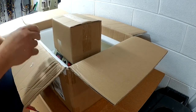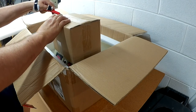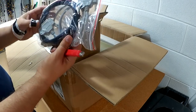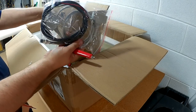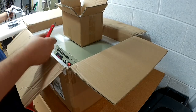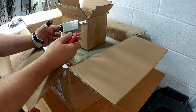There's another box inside. The interesting thing I just realized is that the 3040 came with the steppers already attached — a lot of the unboxings I remember seeing had to attach the steppers separately. Inside we have cables: the infamous parallel port cable, and a fourth axis cable with an aircraft connector at one end that connects into the stepper motor. We also have a power cord. The tailstock for the fourth axis is very light — I don't even think it's aluminum; it seems like some kind of white metal, almost feels like plastic but it's not.